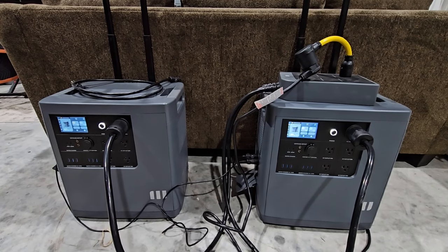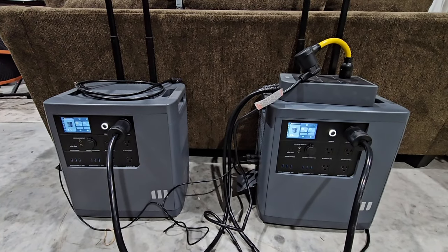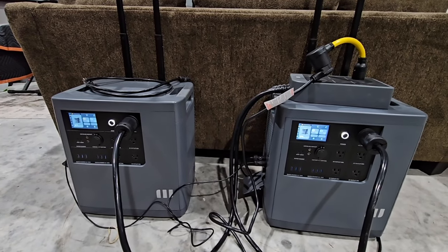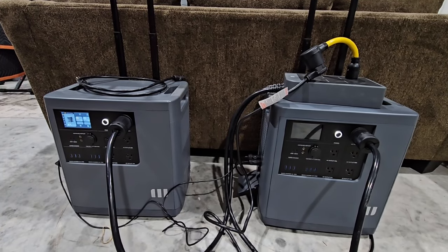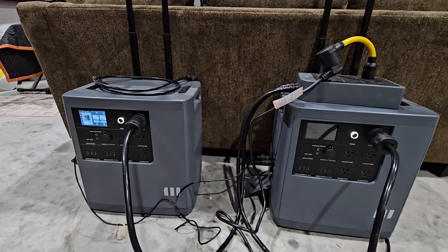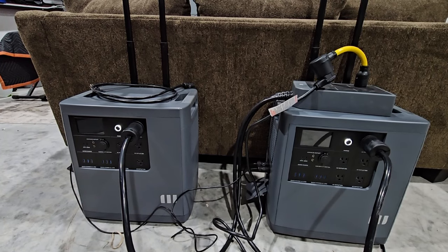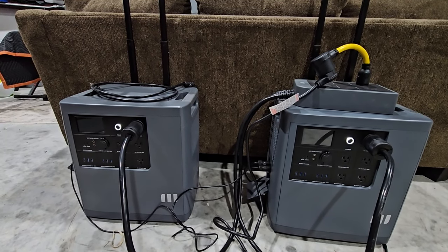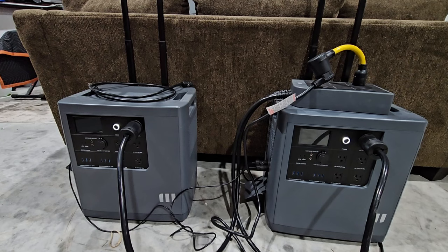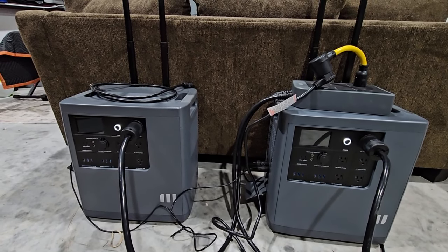When you're talking about an AC unit, which is probably pulling about a thousand watts at any given time when it's running, with the capacity of these being 3,500 watt-hours, you're going to burn through it in about three and a half hours. They do make expansion batteries that can stack on top to give you significantly more runtime if you need power for a longer period of time off-grid. Each one of these with their expanded battery packs can support up to 14,000 watt-hours worth of power — that is absolutely crazy. Which means if an air conditioning unit was pulling off of it and the condenser was running the entire time, that's 14 hours worth of non-stop air conditioning.